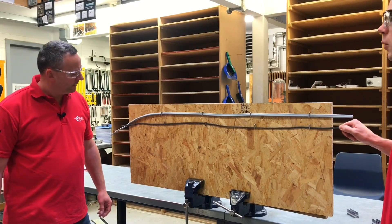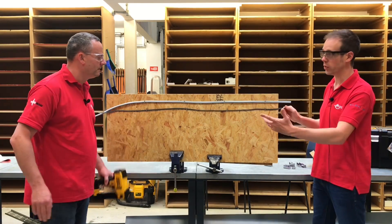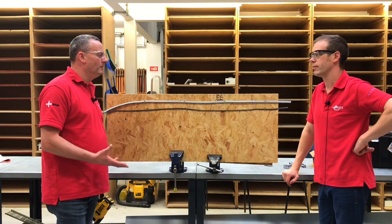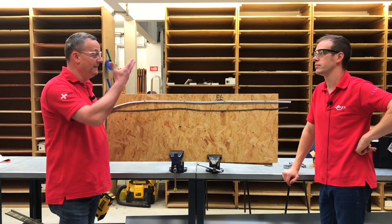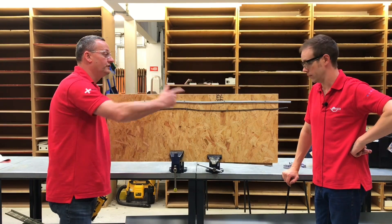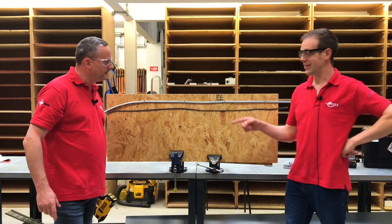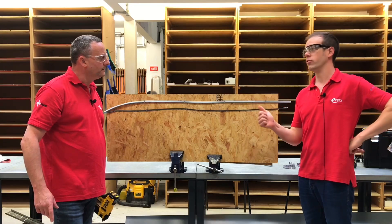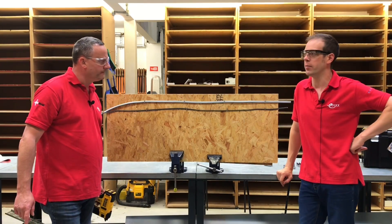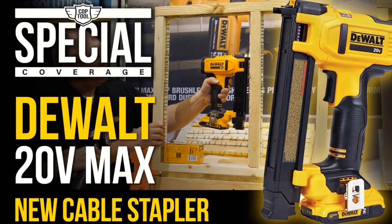People are going to have to decide whether they're happy with that amount of movement, or whether they consider it supported and meeting relevant requirements. Timber frame buildings are becoming more and more commonplace in the UK, and with the internal skeleton made of wood, this would save electricians a vast amount of time supporting cables. It's worth noting this is not designed to clip into masonry, block, or breeze block — it's designed for timber surfaces.